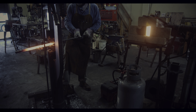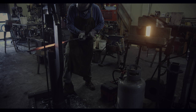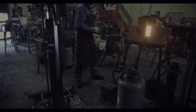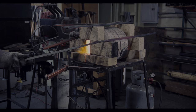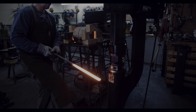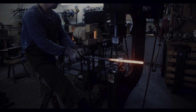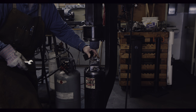My final spacer is going to be 3/8 of an inch, or 9mm. I will use this spacer only to widen the billet, as I want to use the wide part as my cutting edge. After a lot of work, I sometimes give this a rest and let it cool down — it gives me a little rest as well. I am now at the final dimension of the billet and will forge it flat on one side to widen it as I had mentioned before.